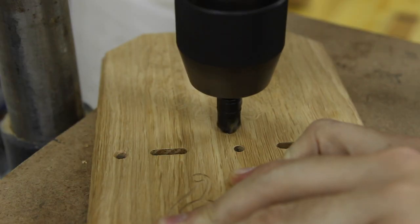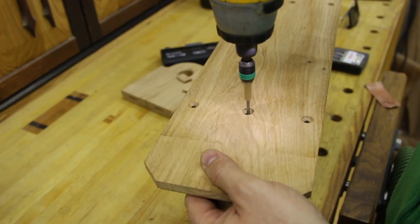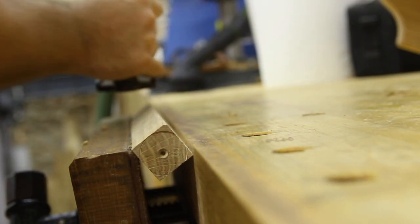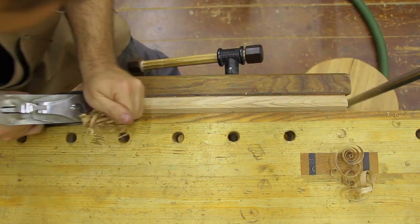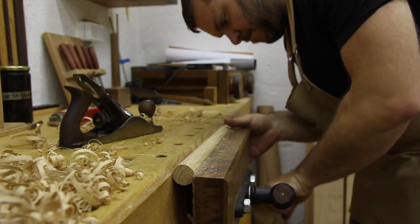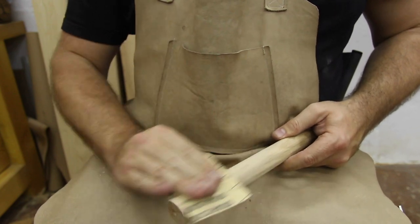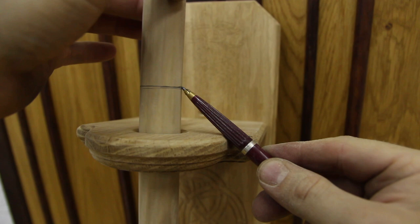Now I drill some holes for fixing it to the wall and it was time to assemble. I assembled it from the back with one screw because the screws on the edges were supposed to go in when the board was wider, but because of the profile mistake I had to skip those holes. One screw and two dominoes will be plenty enough to hold it. I cut the piece that will act as a dowel passing through the paper towel. This could be a square piece of wood — you don't need to make it round — but I wanted to plane it round, producing lots of shavings and enjoying the sounds of the plane.